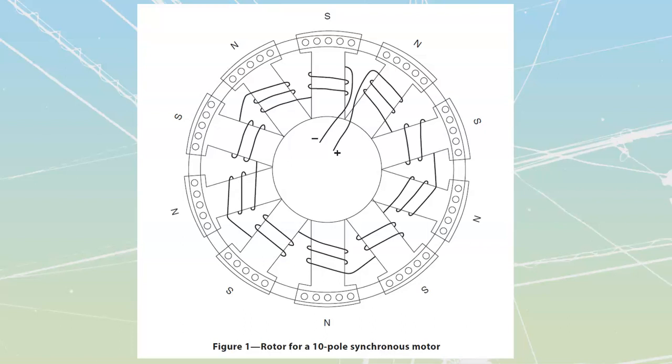You can gear them up or down, but these motors operate at relatively low speed — we're not trying to catch up to a 3600 RPM synchronous field. We bring it down to a more usable range: 900, 1200, or 1800 RPM. Because of lower operating speed, we can use this more wheel-type shaped rotor — fairly tall but fairly narrow — presenting as huge circular discs with salient poles.